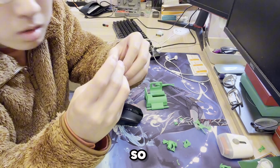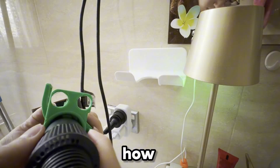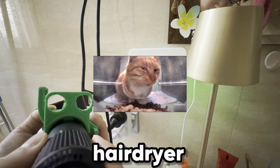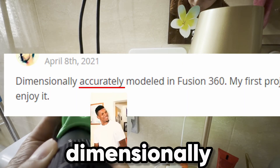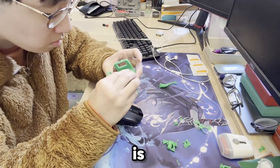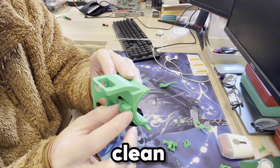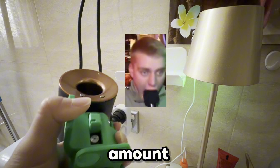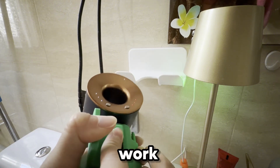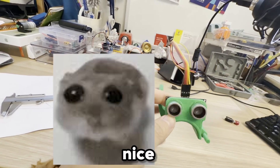On first inspection, I might have miscalculated how thick the shaft of the Dyson hairdryer was. It turns out that the Dyson pre-CAD file I was using was dimensionally inaccurate. A good thing is that the slider I made clicked in really well — I made this press-fit notch design which I'm kind of proud of because of how clean the solution is. The ultrasonic sensor fits, which is nice.